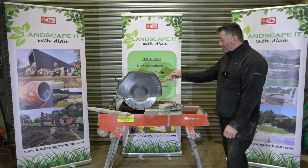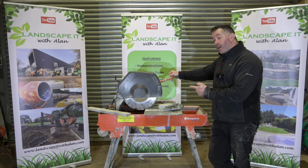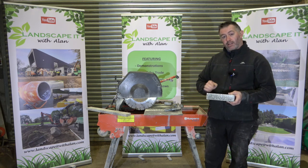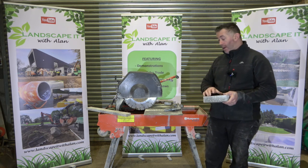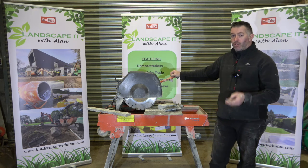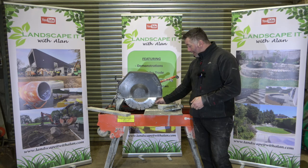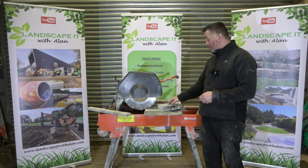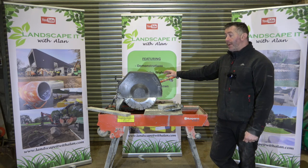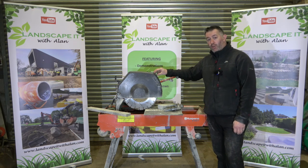The power in the saw is very, very good. Once it's not abused and you feed the material through very nicely, you will see in the little clip that the saw is well able to cut through. In the video you see it cutting through a 50mm paving brick — the quality of cut, the speed of cut — and you can see the water coming from the machine to keep the dust down and keep the blade cool. Blade selection is crucial to one of these machines.